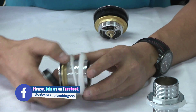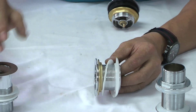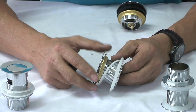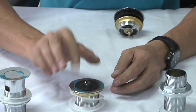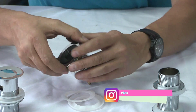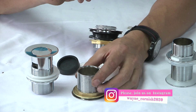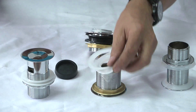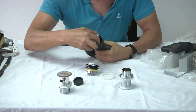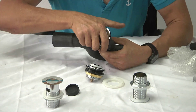Then we have the oldest style — the bath plug. This is a bath waste and it is measured at 40 millimeter. The way you put the waste fitting in for the bath is the same as for the basin. With these type of waste fittings you would actually use some window putty to install it. You can see the 40 millimeter thread is way shorter because the bath only has a thin little base at the bottom. This would fit directly into a bath trap with your clamp — that's how you connect a waste fitting to a bath.